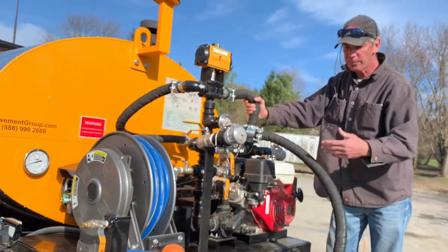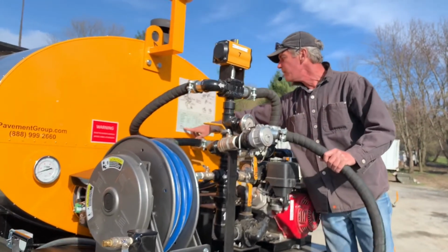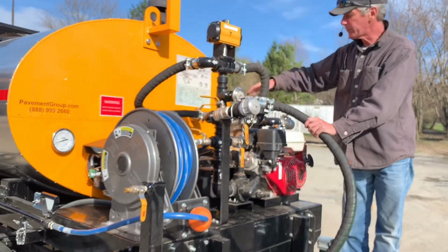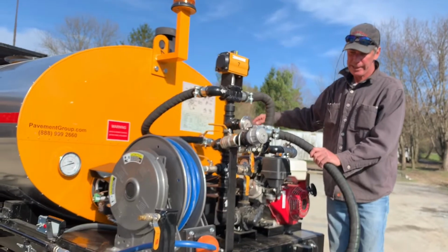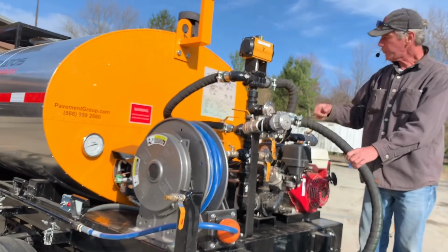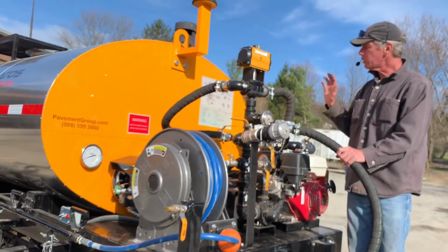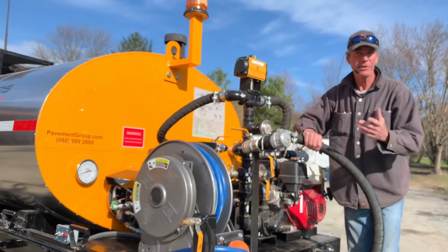And then once those are purged out, at that point, we'll go to cleaning out with solvent recirculation through the system. We'll pump material from a solvent tank through the system. We're not going to return it to the tank. It'll only return back to the solvent tank or out through your spray bar tips and nozzles or through your spray wand. And then once you get those purged, you just let it recycle for a little while. It'll all go back to tank, and leave that in the system for the day until your next time you run the machine.